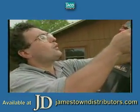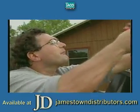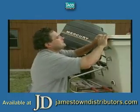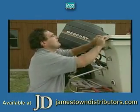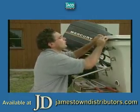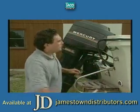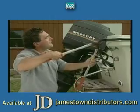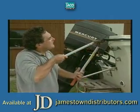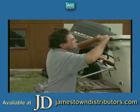That should give us a nice smooth corner. I'm going to cut off any excess here at the corner and then install the factory end cap. I've done with this insert like we did earlier — put it out in the sun and let it get warm for a little bit so it's easy to work with and we can manipulate it. I'm going to take the pruning shears and cut this and slide it into the end cap, and we should have a nice brand new rub rail fully installed.